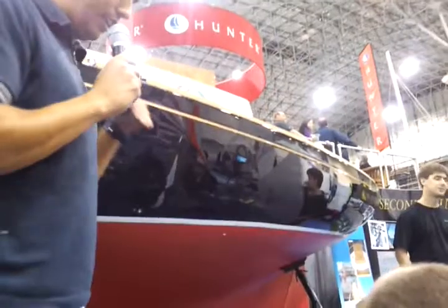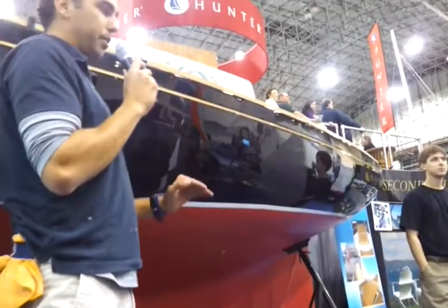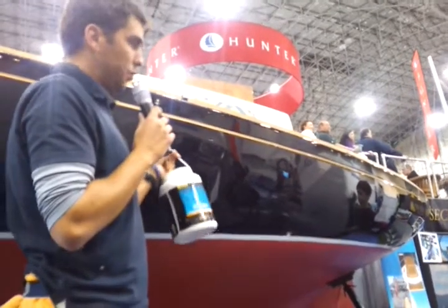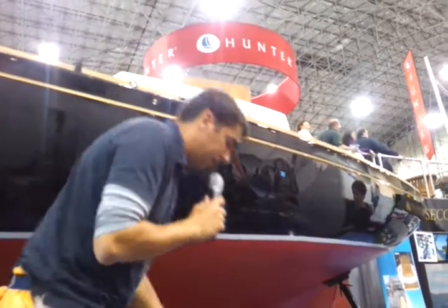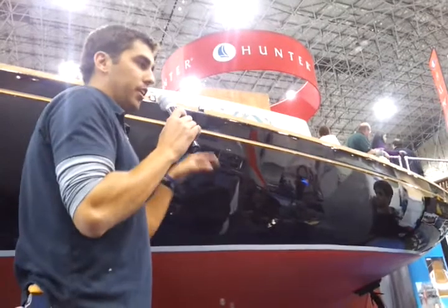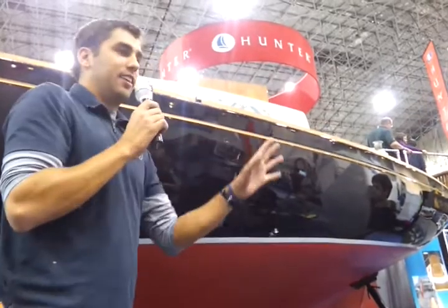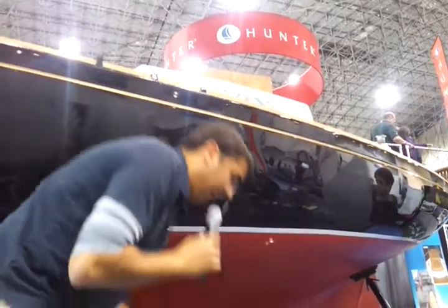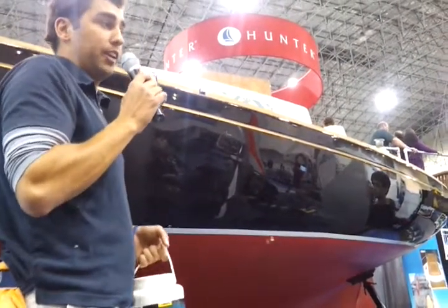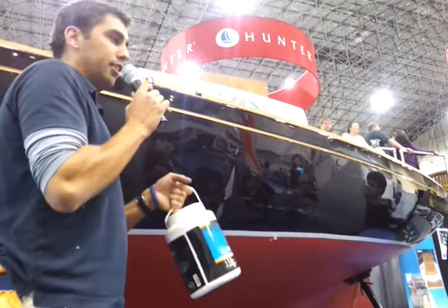Yep. And I think 3M has really gotten good at knowing, this is our heavy grit, we're going to start our heavy grit here and our medium grit here. Products all across the board. This is Orca. I'm showing it because it's a water-based compound, not an oil-based compound. Sometimes if you're using an oil-based compound, you'll have a little bit of a fake shine, we call it. You're done with the job, it looks great, and a week later, it doesn't look as great. That's not a typical example, but the water-based compounds work a little easier, they're easier to clean up, and when we work in green marinas, where people are really concerned about the environment, they do not have as many harsh chemicals. It's still a diminishing abrasive, so it will still break itself down.